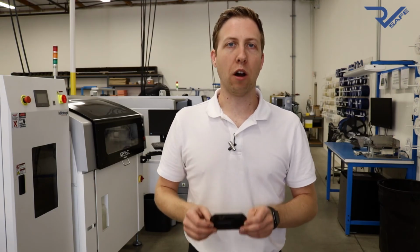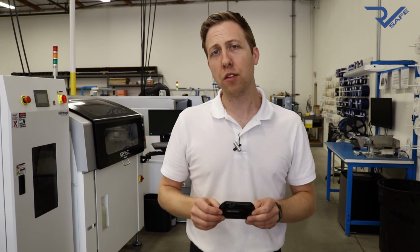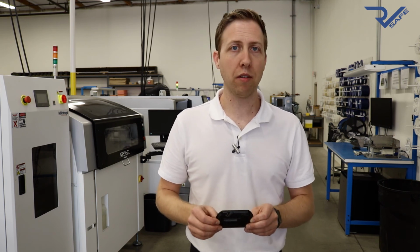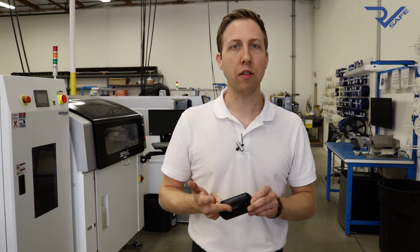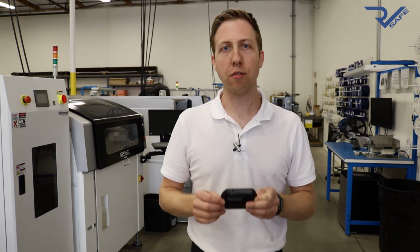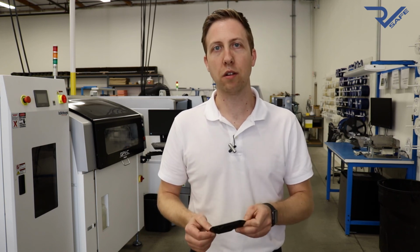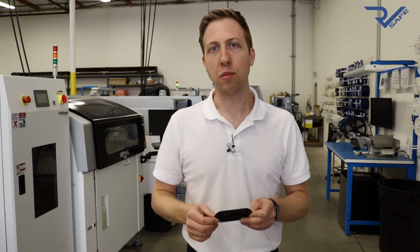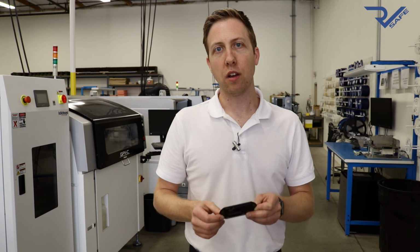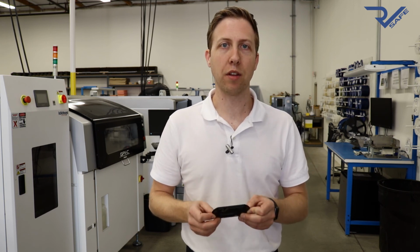I would recommend always teaching your customers about their carbon monoxide and propane alarm. The easiest thing to remember is that if your alarm ever goes off, open the doors and windows, turn off any open flames, leave the RV immediately, and turn off the propane tanks. Next, check for any sources of carbon monoxide. This could be from running car engines, like from a motorcycle or an ATV, or even a portable generator running outside. It could also be from a faulty fridge or furnace. Also, if you smell propane, take your RV back to the dealer where they can investigate it and figure out what's wrong.